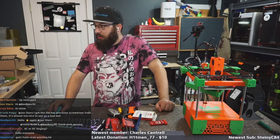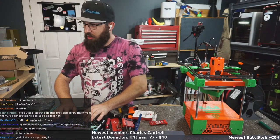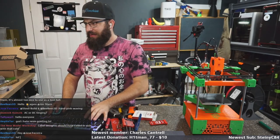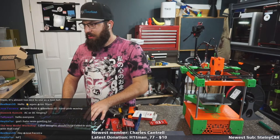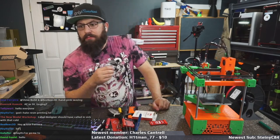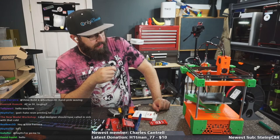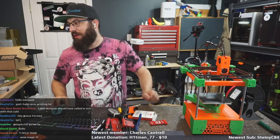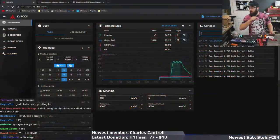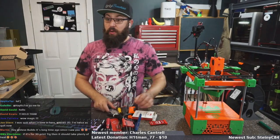So yeah. Oh, okay, so that is done. So save, config, and drop the bed. Up. Yeah, the bed dropping all the time is kind of annoying, but it is what it is. Okay, now we PID tune the bed.